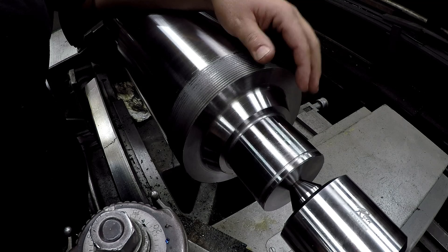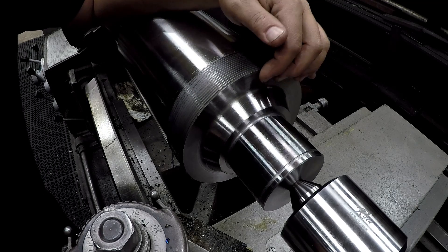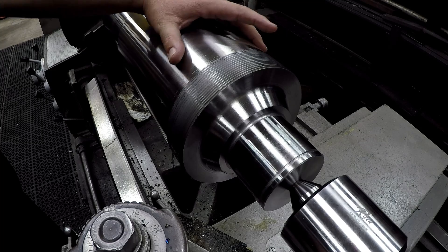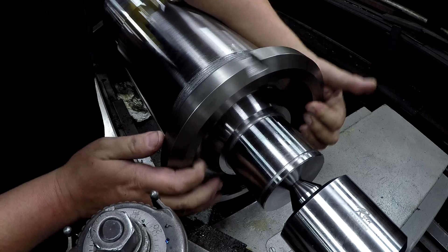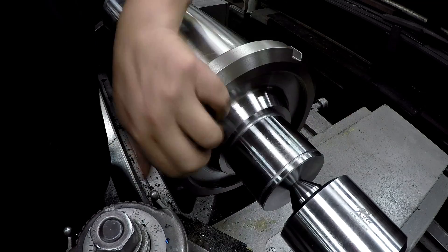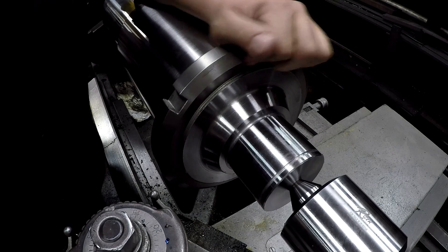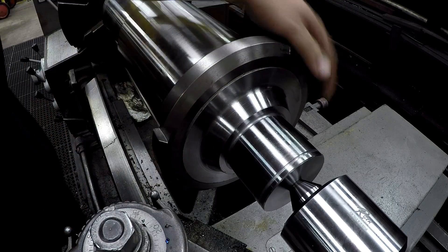This one put up a fight. I didn't feel like turning the camera back on but we got it done and it's not pretty. This thing was chattering on me and I was running at the slowest speed and had to take a few skim passes to get it to go — but this is what happens when you have a non-rigid machine and you don't have a steady rest to support it. This is too big to fit the steady rest I have for this machine. I need a larger steady rest. But we got it on there — it's a good fit. It just has chatter down in the bottom of the thread and I don't like that. Everything else on the shaft looks good, so we got that done. I just need to do some final polishing, remove the filler edge, and polish that journal where the chips put some scratches in it.